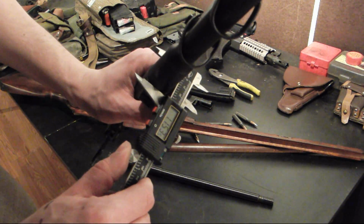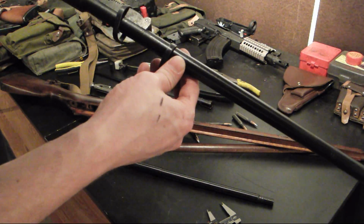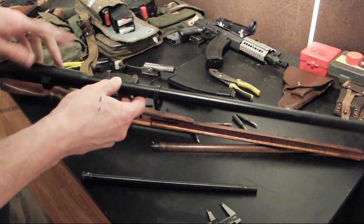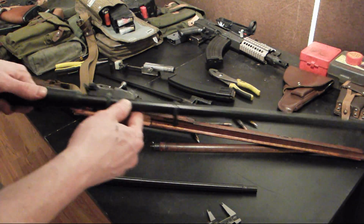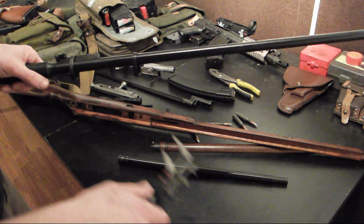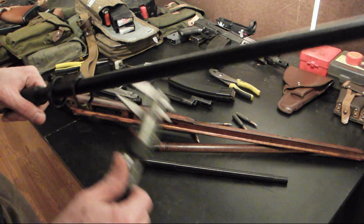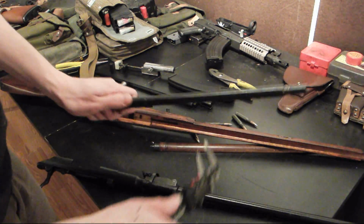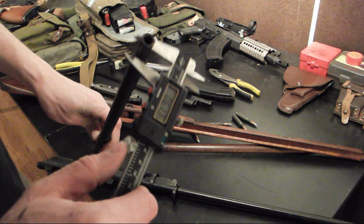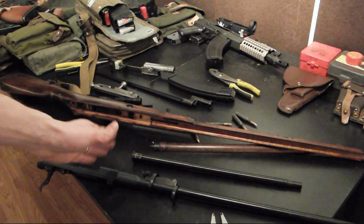I've got 1.15 inches. So now, I could cut this barrel down, theoretically on a lathe, let's just say, and I can probably make one good barrel for a PPSH, because the receiver ring end here is plenty large enough to make this ring on this piece, on the Mosin, on the PPSH. However, you'll notice that quickly this barrel goes down to .710 almost immediately. Now, if you remember on this barrel, this section right here is about .600 already, so I can still make this. Now down here, about .471. So I can make this whole step profile on the PPSH barrel easily.